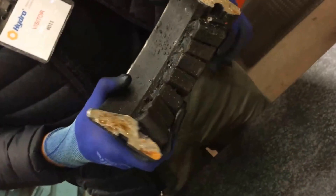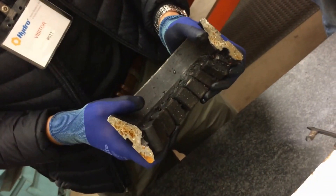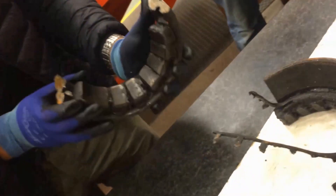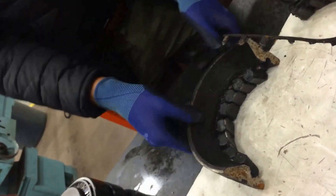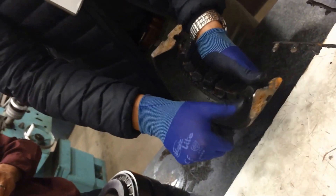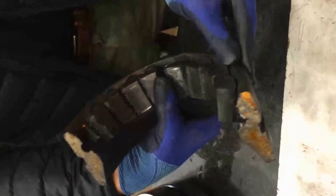This bearing — you've got to be kidding me. That is so cool. That's a failure. Holy. I've never seen rollers do that before. This is a good option — we can just babbitt these and turn it into a radial bearing. Actually, you could put that in a museum. Chroming fixes everything. So from looking at that, do you think that would be the unloaded or the loaded set? This is the loaded set — you see? It's good on that side. Aside from all the rust, this raceway is fine. And it is basically the cage that has melted beneath it — cage failure. The cage has cut into the raceway.